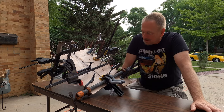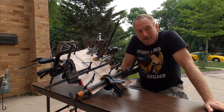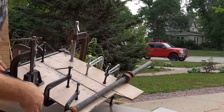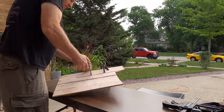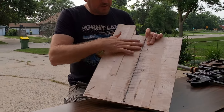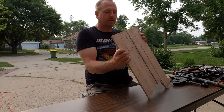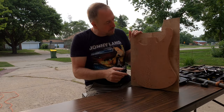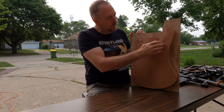We're going to route the top to match what's on the back, and need to level and sand off the face. I think we're going to find some really, really good curly maple in here. I've got it all taken off. As you can see, this is really rough and very uneven at this point, but that's not our concern — our concern is how did this seam turn out? And it's looking very, very tight, very good. The next step is I'm going to use the bandsaw and cut very close to this without touching it, and then we're going to route the rest out.